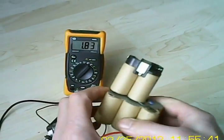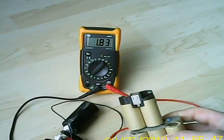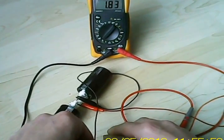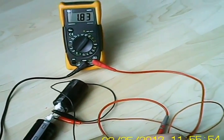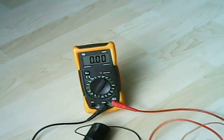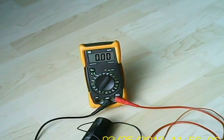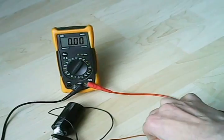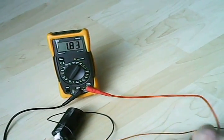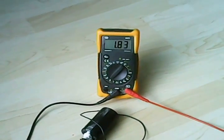Let's see if the top — yes, this one connects to this one. So I can put my minus terminal probe on this one and go to the next cell. Let's have a look if it has any power. 0.0.0. Let's check it. Yes, I am connecting to the top. Let's put some power on it. 1.2.3. Here we double check — plus, minus. Always be sure. You don't want to ruin the battery.